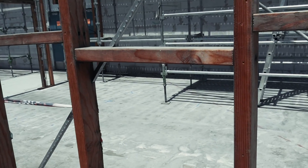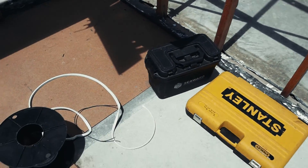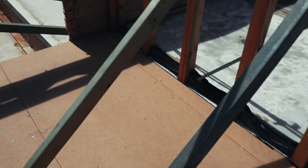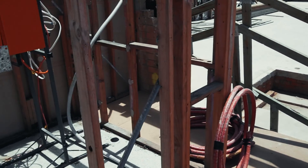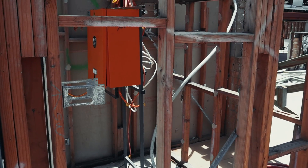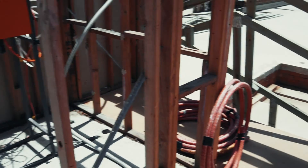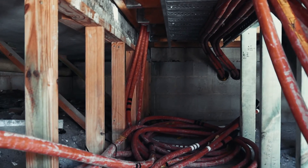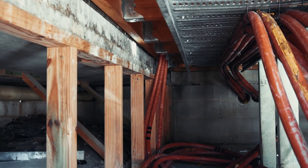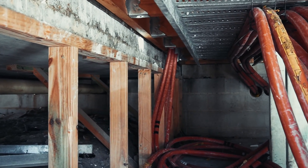We're going to have to go to the main zone cable tray, all underneath there, underneath that floor with a core hole through here. We've got a tray going underneath here. Four and a half meters down is going to be where the board's going to end. This is underneath that switchroom — we've got our two sets here ready to go, and they will be live once we do the termination from the pad sub into that pillar.